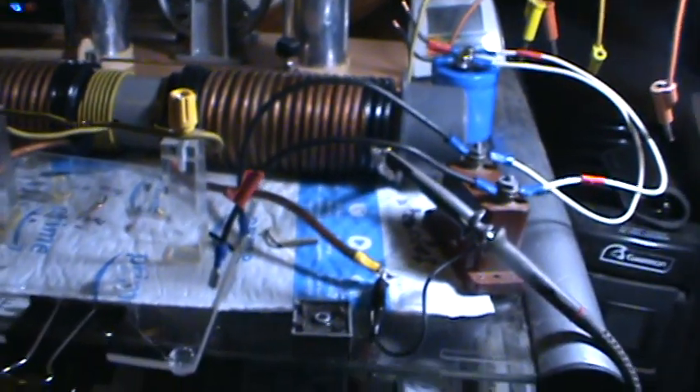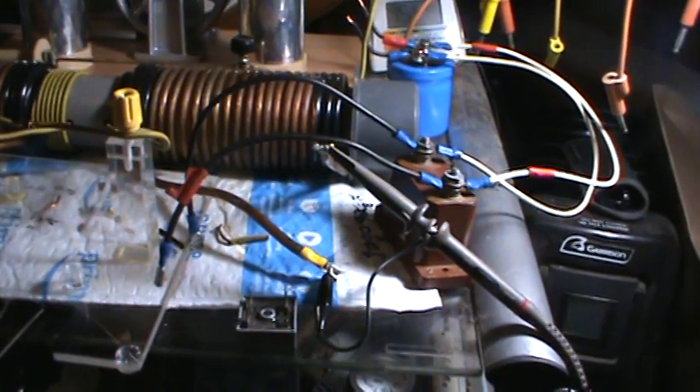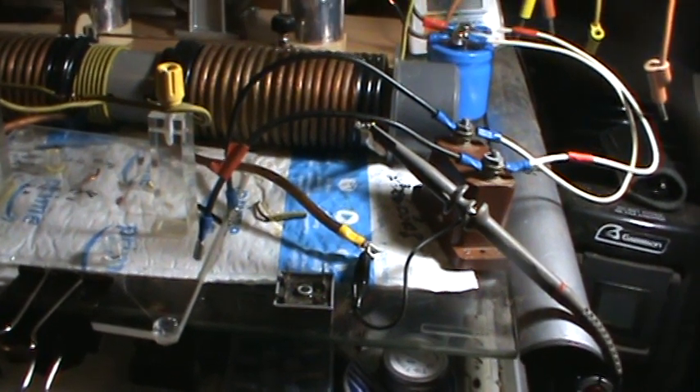I don't know if it's going to flash here or not for us. You can see it, but it's going up to — I think it's on the 10 scale, so it's going up about 30 or 40 volts pulses. Actually, I should try something. Instead of going with the full-wave bridge rectifier — I think it's the back EMF pulse I'm picking up. So I might try something else here.